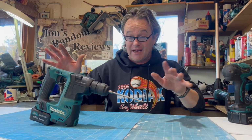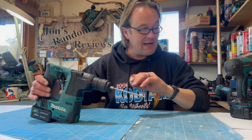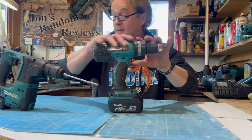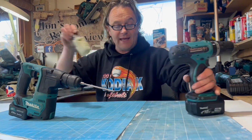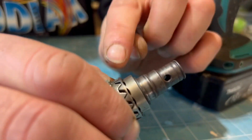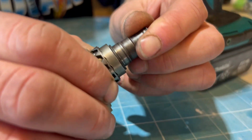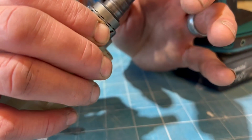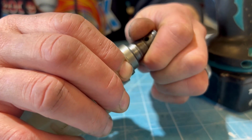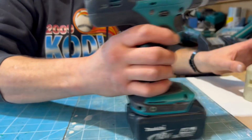Now, what is a rotary hammer system? Well, I might actually take one of my other drills to bits to show you. This is a percussion drill bit here, and I've got a demo on the inside of this one. This is a different model, but if you look up here closely, the percussion bit is this bit here. See how it rattles against there, them little lugs clatter. So in reality, it's more like an impact driver the way it works. It just bumps off these bumps, and that turns it into a hammer drill. This is the same as what's in here.